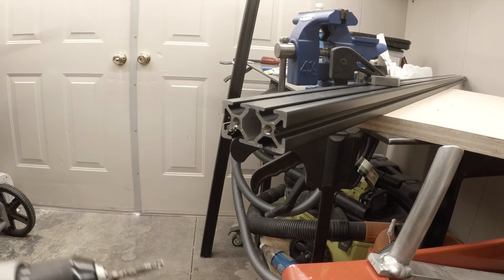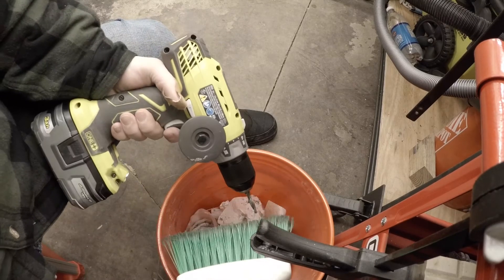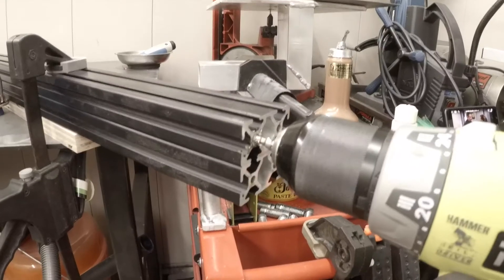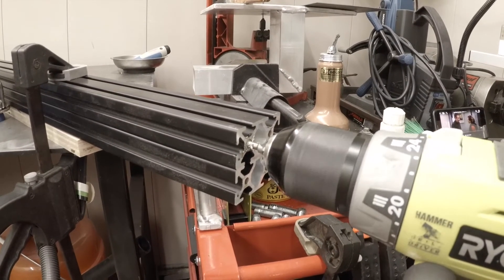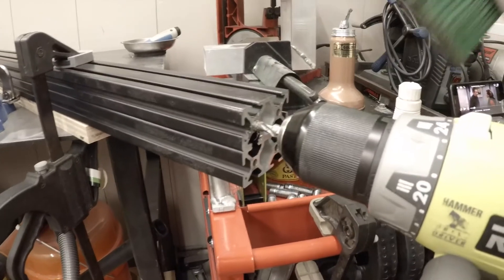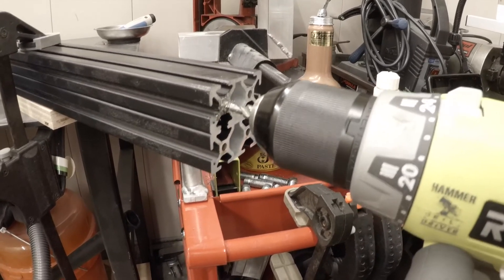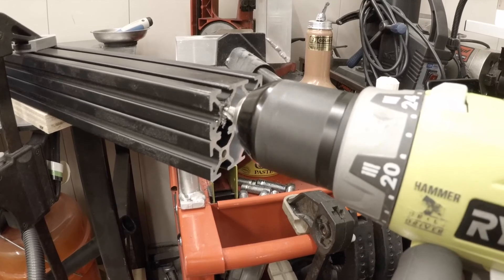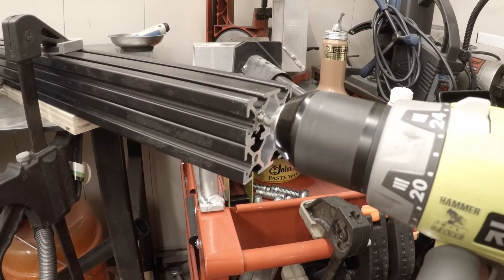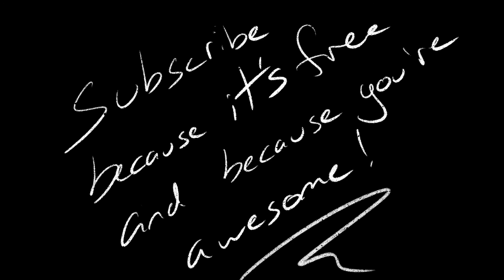I really think the combination of everything here — the oil, the amazing DeWalt drill bits — makes this a really fantastic tap set. If it starts binding up on you and it's not progressing at the rate I've shown, back it out a bit and wipe it off with your plastic bristle brush to knock off a bunch of the shavings. Then work it in and out again and it'll go in.